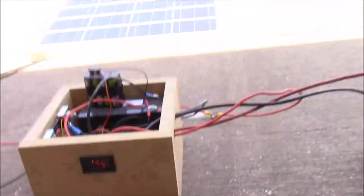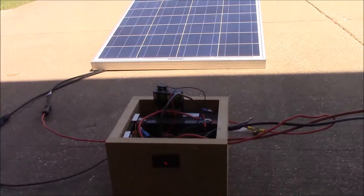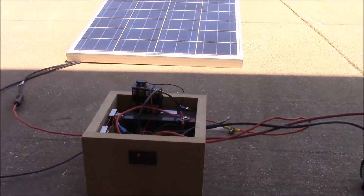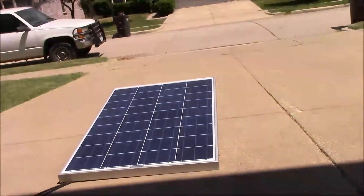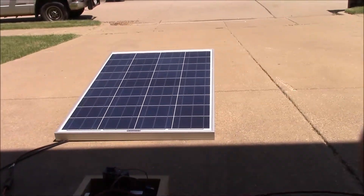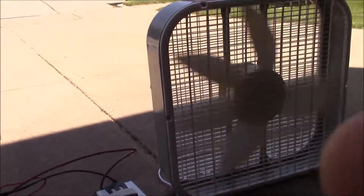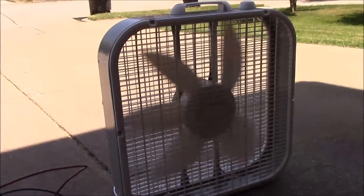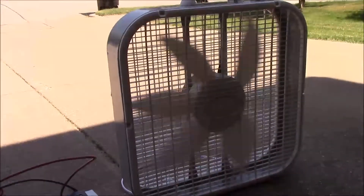So what's the bottom line? You can power a box fan like this pretty easily with a modest solar setup. With a 100-watt solar panel, you'd want a little bigger battery than I've got here for testing — maybe a 10 to 15 amp-hour battery as your buffer. This is very doable. With a couple hundred watts of solar panels, you could probably run two or three of these fans no problem, around the clock while it's sunny. Hopefully that was interesting and helpful — fans are definitely a common need during a power outage, and they're very easily powered with solar. Thanks for watching!